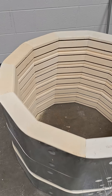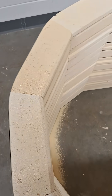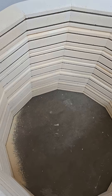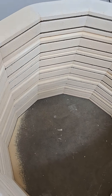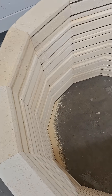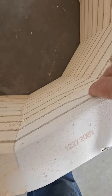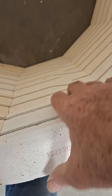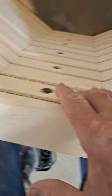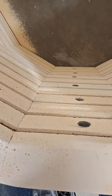What I had to do was replace these two bricks right here with brand new ones. It would have been a relatively quick and simple swap-out job — comparatively speaking it's easier. But I couldn't do that, so what I did was I pulled the pins, working around from the transition brick — this is called the transition brick — all the way around to where I was past the two broken bricks, and then I was able to pull all the pins.